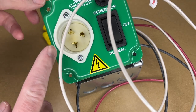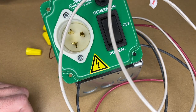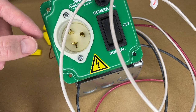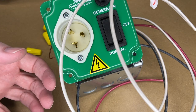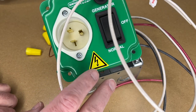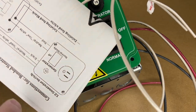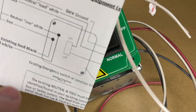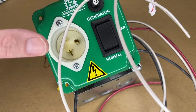Since this will detach the neutral, it will completely break away the appliance from the mains power. You don't want a situation where you plug a generator into your system and it energizes the power lines, because that can feed back into the transformer at the pole and make the power lines hot while power crews are trying to work on them. So you want to make sure this gets installed properly and that you read and understand all of the instructions, including the parts about generators with floating neutrals.